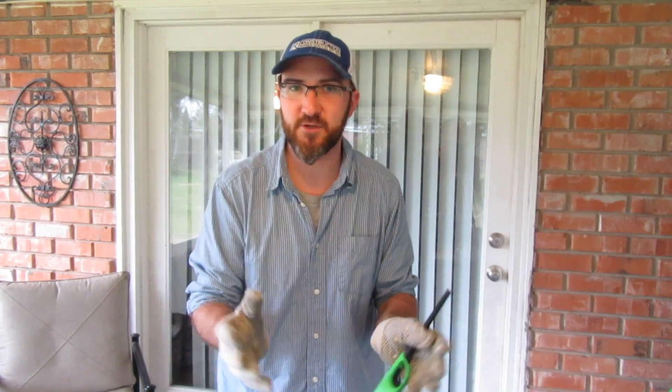So next, now that we have the torch inserted into our forge, we're going to do a very low temperature burn on it because we want to just finish drying it out. We don't want to trap any moisture bubbles inside the plaster because as the water begins to heat up it'll evaporate and expand and it'll start popping plaster out — and we don't want any hot plaster popping at us. You may want to experiment with different torch heads. The primary thing you need is that the torch air breather holes are outside of your forge. This is a uni-directional flame so it's going to shoot a longer flame out. You may want to experiment with an omni-directional one that has a shorter flame and just a wider one.